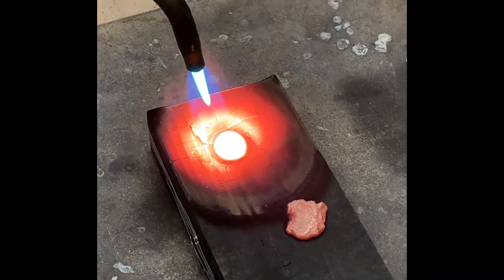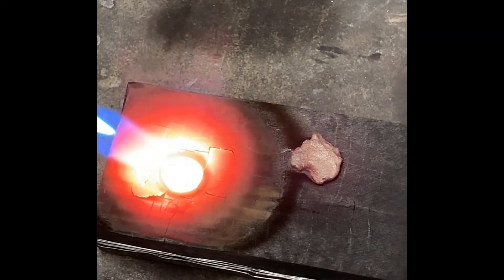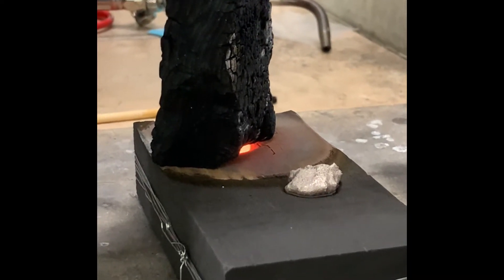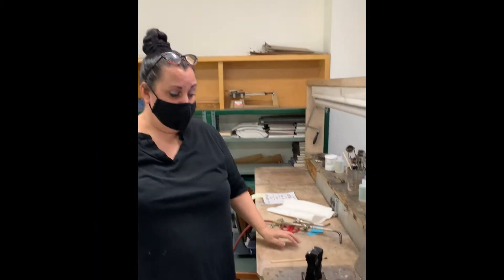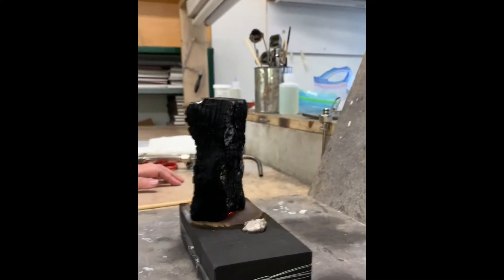Super fun. I'll turn it off and use a clean end with no binding wire on it. Then you very carefully squish it. If you squish too hard, gold could squirt, which you would really not want. Because when it's really hot liquid, if you just went at it, it could spread — which would really suck. This just takes a few steps going through the mill. It helps keep some of the oxygen out and compress it a little bit.